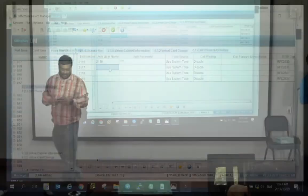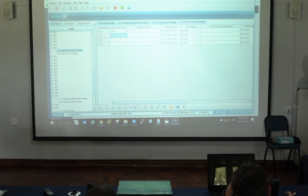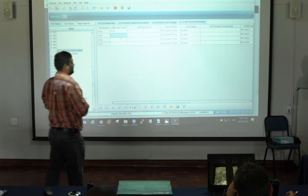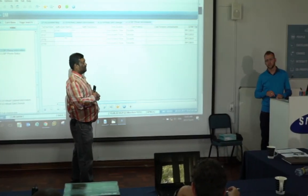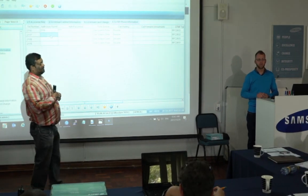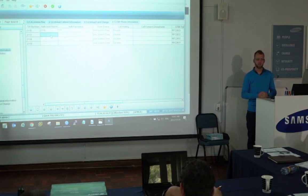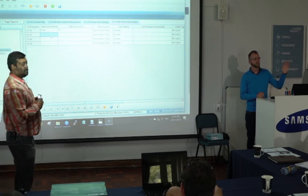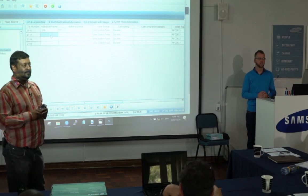Keep in mind, when we set up on the hosted solution, it's on a private end, so there's no access from the outside end. However, if you connect this equipment to the client's network, someone will come in from the client side, access our equipment, and try and make a call out. That's why we want our equipment away from the client's equipment. That's why in the install that you've done, passwords are four zeros, because you've got a private network. No one can access it from the outside.